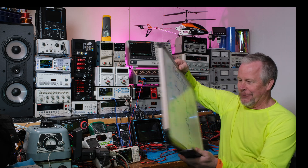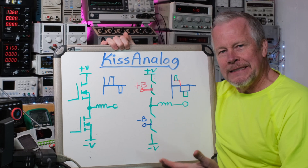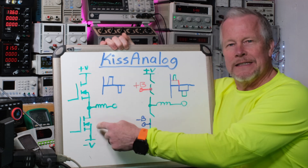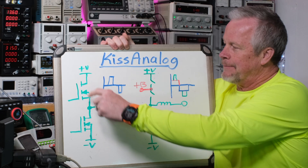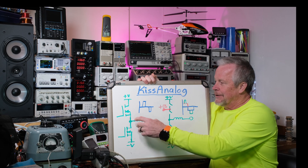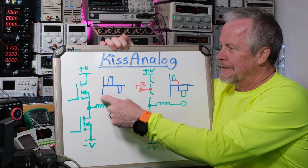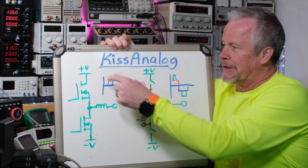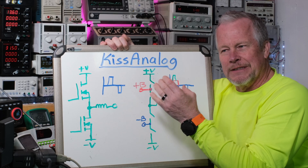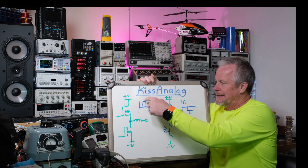So here I'm going to show you this little board I made. Basically, on an inverter the output is like many audio amplifiers — you have a push-pull transistor configuration. You have one transistor tied between the output and the plus voltage rail, and one tied between the output and the minus voltage rail. On a modified inverter, there's a time delay, then it pulses up — this transistor turns on and pulls up to plus V. The inductor tries to shape it a little, but it's pretty much a square wave — a modified sine wave AC waveform.